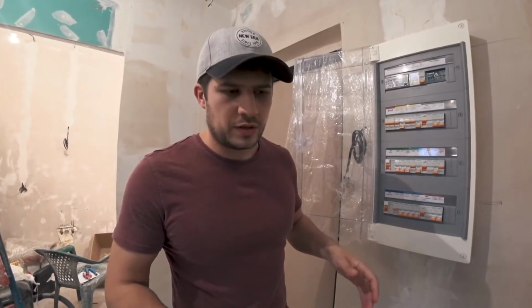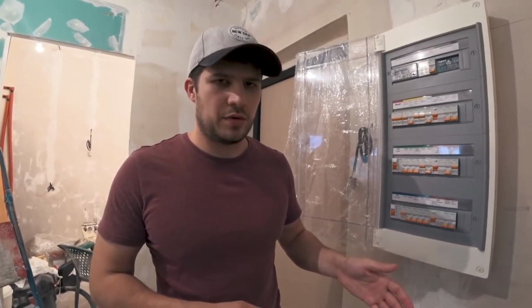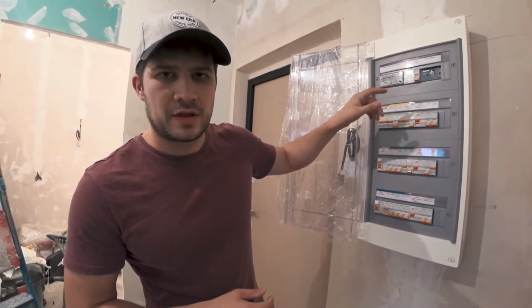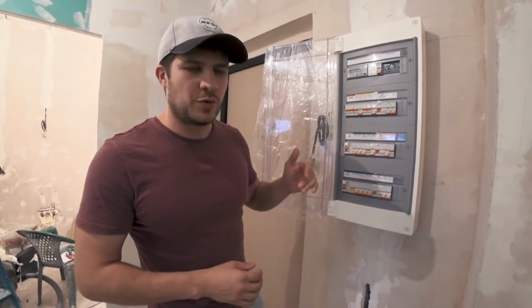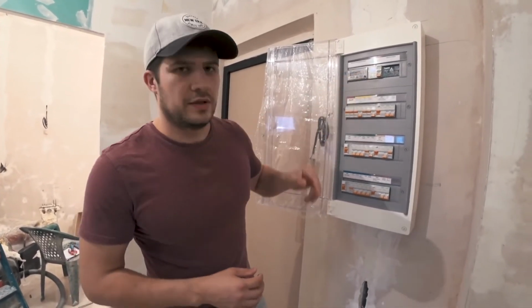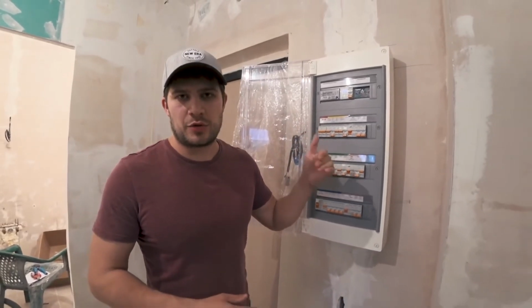We also had a little mishap at first. During the initial installation, right after, the voltage limiter would cut the power every now and then. And it turned out that the factory setting of the upper limit of voltage was set to 240 volts, and whatever it was hitting that limit, it would cut the power to the apartment. At first, nobody understood for a long time. Then we started looking: the factory setting was 240 volts, or 242 volts, the upper threshold. So after that it would shut off. And here, in principle, such surges happened often, apparently sometimes at the peaks it would just reach 240 volts, and the relay would simply shut everything off.